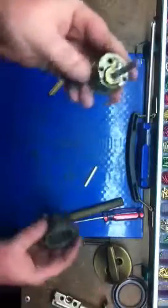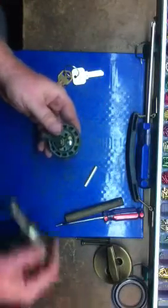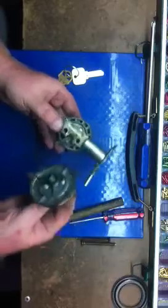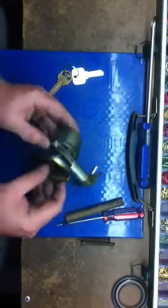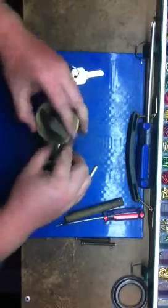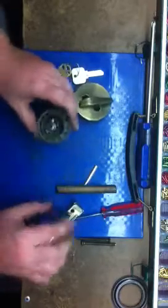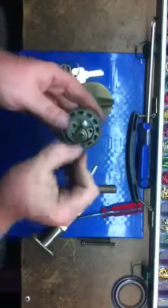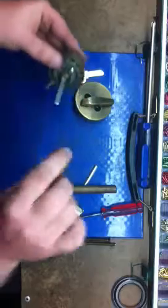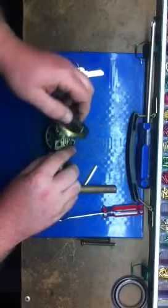Your outside fits around the housing. The latch goes on whatever direction it would be on your door to fit appropriately, same thing with your thumb turn. In a different episode I'll show you how you have to time the deadbolt with this tailpiece — otherwise if it's not in the correct timing, when you turn your thumb turn it won't unlock. That'll be another video; it's real easy.